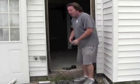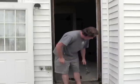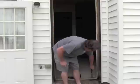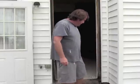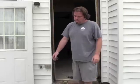After we get all our nails pulled, we want to check the framing around here just to make sure it's not rotted. That's pretty sound. That's pretty sound too. This one obviously has signs of it getting wet, which probably caused the rot. We'll make sure to take care of that when we put the new door in. So our door jamb is all cleaned up and ready to go.